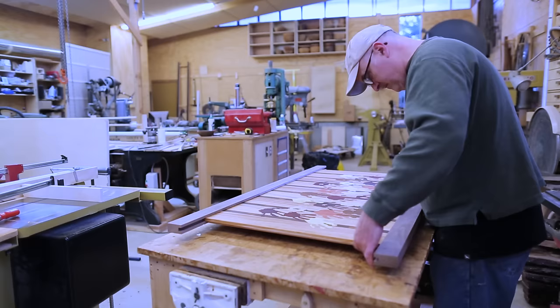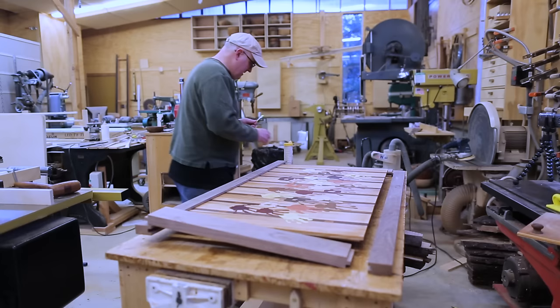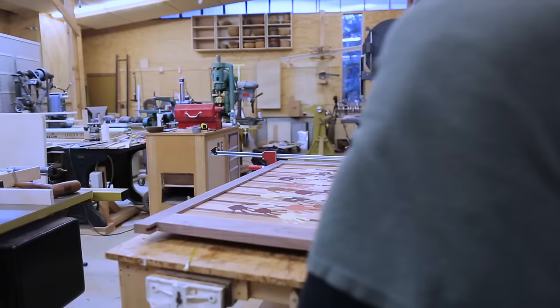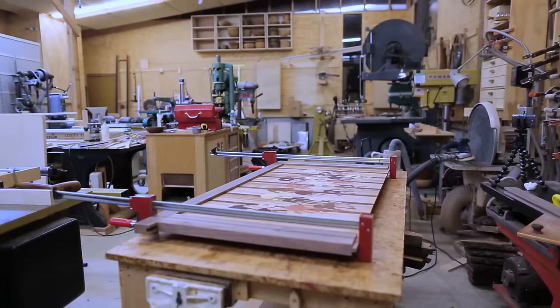To put the frame on, I raised the panel up a little bit, put the long pieces on first, then the short sides. I dry-fit everything and made sure it all fit nice and tight before getting the glue out. Once everything was fitting perfectly, I glued one side first and let that set up, then glued the other side on. On the length, I left about a quarter inch because the piece is going to expand and contract quite a bit — it's all side grain for close to four feet. So I was only doing two joints at a time instead of all four at once, and it all worked out.